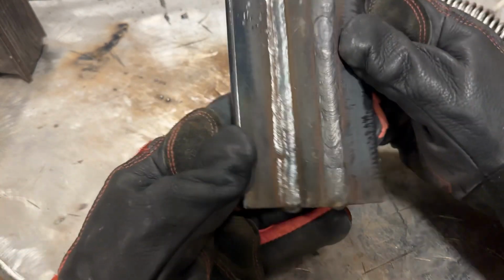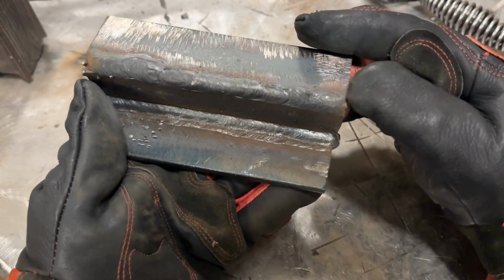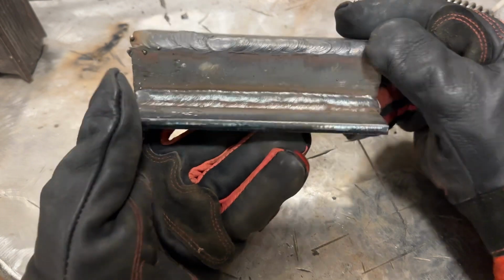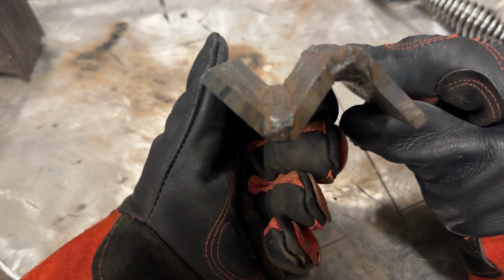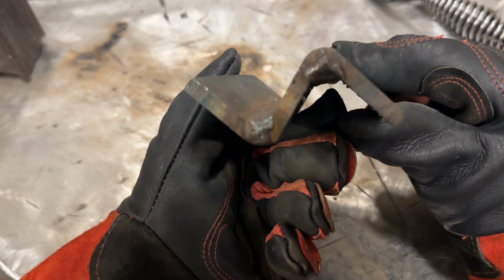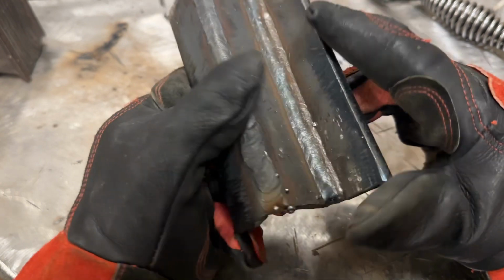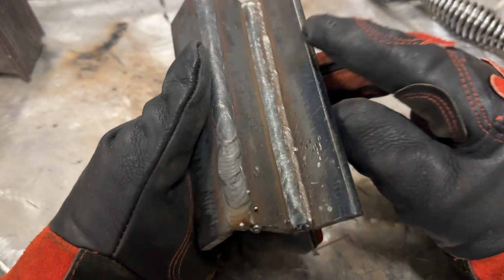And the 1/8 inch rods, which I can't remember which way I was welding it, and I still have a lot of dust in there. And even rust, since it contact rusted, dipping it in water. But you can see the overall beads are far flatter with the bigger rod. Only 3 passes it took to get to where that is, whereas this 3/32 is a little bit taller. But far more metal every pass, far easier.